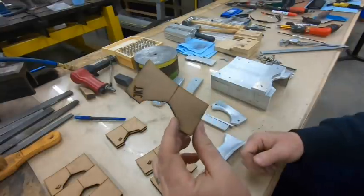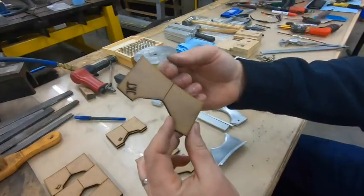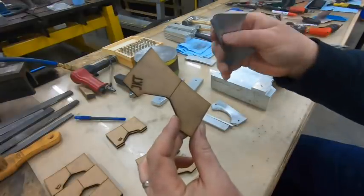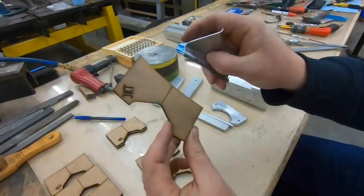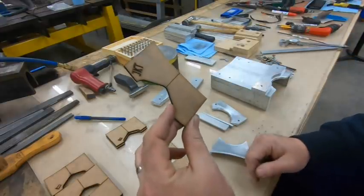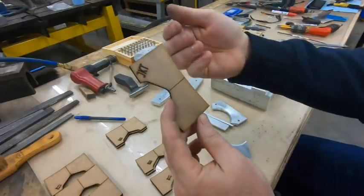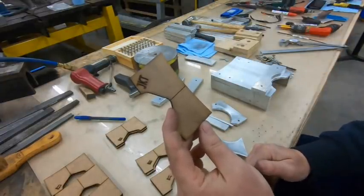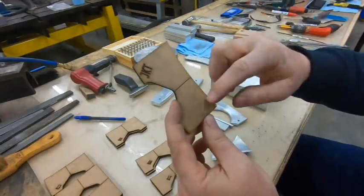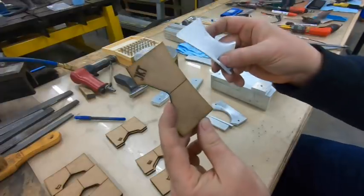It's really important to note that the Typhoon's fuselage isn't an actual oval, so the curve is not the same on the top as it is on the bottom. You can't just have a true radius throughout — it has to fit exactly, because there are going to be rivets holding between the frame and this flange here. It has to fit tightly or you'll end up with puckering and sucking into the material. Also, the form blocks were designed to be shaped over the inside mold line, so we're off by a material thickness. I went in and adjusted them by 40 thousandths of an inch — which is the frame thickness — and offset them to the outside mold line, because this component is going to wrap around that.